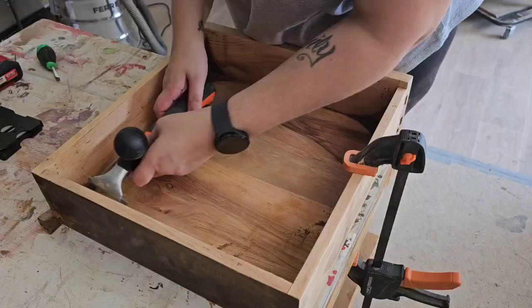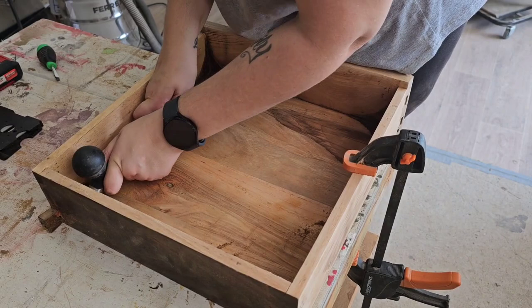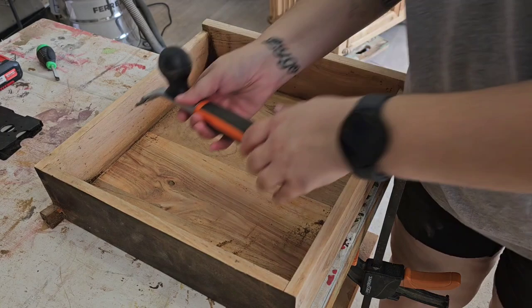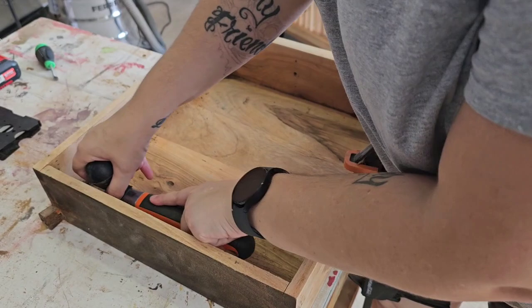2 weeks later, I thought I had all of the sanding and scraping done on these pieces, but as it turns out, I forgot to do the inside of the drawers, and I really didn't want to leave them dark. They were as dark as what's on the back of the drawer there, in the bottom of the screen. I used my electric sander to sand everything I could, and then went in with my carbide scrapers and a piece of sandpaper to clean up the rest of it.